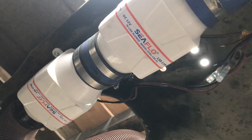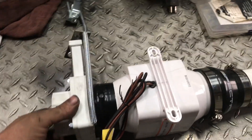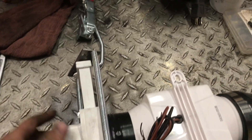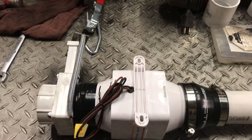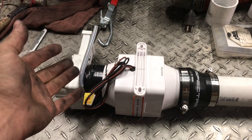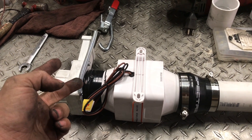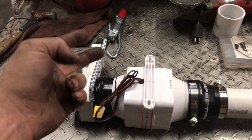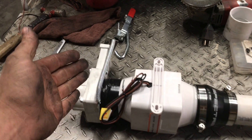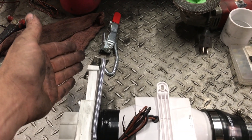Here's going to be the actual air inlet for the system. This is our other dump valve — it'll be spring loaded. Just like the back one, we're going to have a control handle inside the cab where we can open and close it while we're driving. You want to be able to control the system as easily as possible. In my other truck, both of my controls are outside of the cab, so I actually have to get out of the truck to start the system up and to shut it down. With the Dodge, I'll be able to warm up the system from inside the cab and shut the system down from inside the cab.